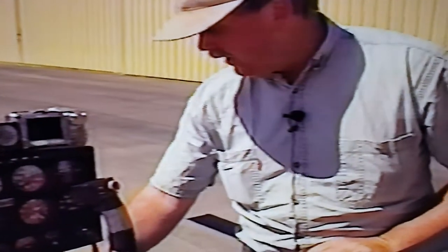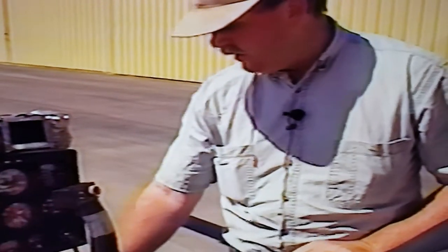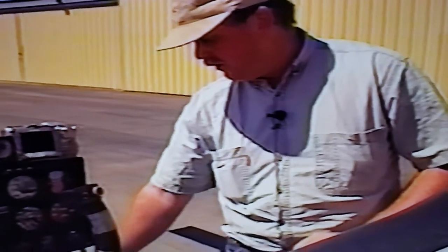The fuses are really circuit breakers — the breaker pops out if there's a short rather than actually blowing a fuse. I can control nav lights, the clock, and other accessories right here. Typical starting procedure is pushing the mixture in, turning the master on, and flipping over to both magnetos. Once I hit the start button, this thing will fire right off and we can begin flying.